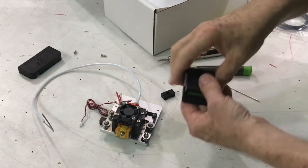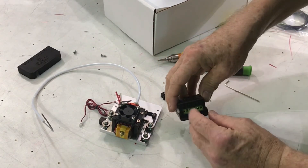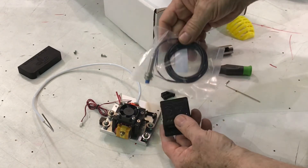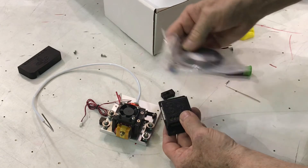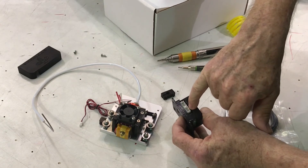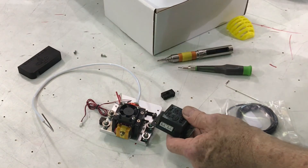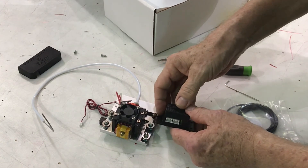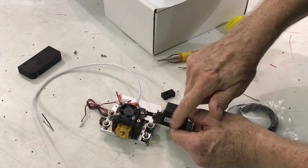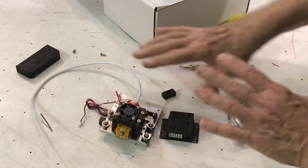This is the brain for it — it's basically a relay. Terminals two and three are your plus and minus DC current coming in and you can hook any NPN or PNP probe to this little unit, called the Simple Probe because it's very simple to hook up. It plugs right into your CR10's main harness where the Z switch normally does. It's got normally open and normally closed options, which means you can use it on any type of printer. The CR10 has a normally open switch which closes when contacted, so this works either way.